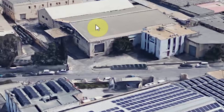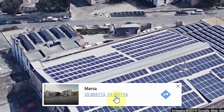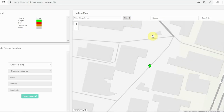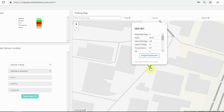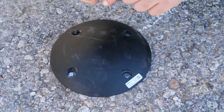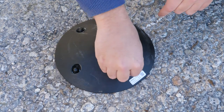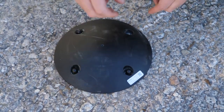Step 9: Take note of the sensor's latitude and longitude and update the location of the device on the online platform as described. You may check the sensor's dashboard message to confirm correct operation. Upon confirmation that the sensor is operating correctly, which means the sensor is showing up green on your map, apply the 4 security caps and the initialization procedure is now complete.